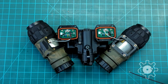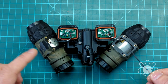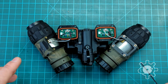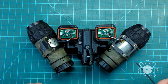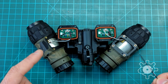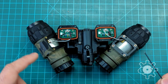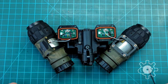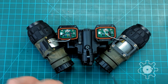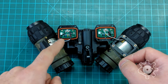This here is what your final wiring configuration should look like. Pay extra attention to make sure you've done it exactly as shown, because if you don't, you may have issues — like one pod has gain while the other doesn't work, one pod is stuck at half brightness, or they both gain down but one is slightly lower so one tube gets brighter when you start adjusting. If you experience any of those issues, come back to this part of the video and verify your wiring.